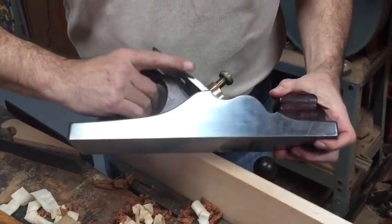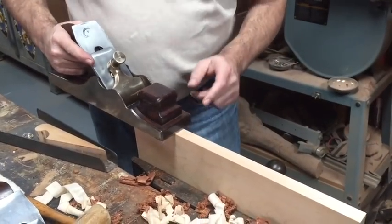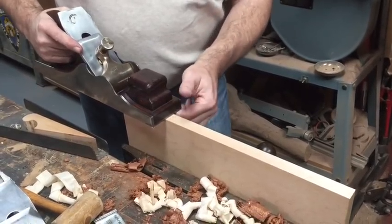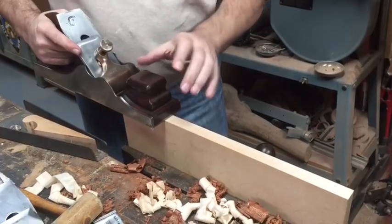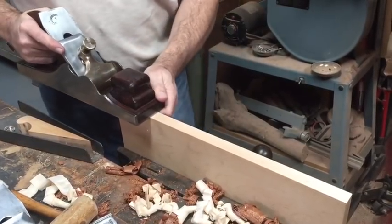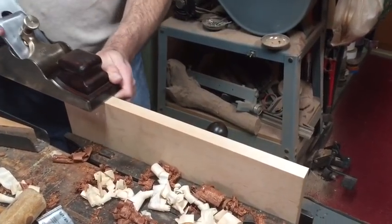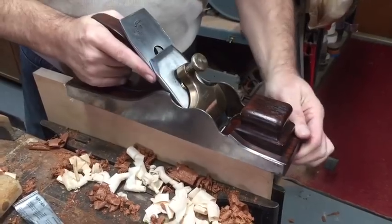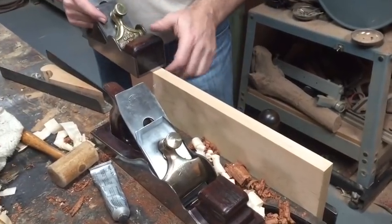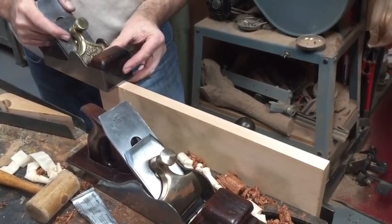The hand grip is a little too small for my fingers so I keep one or sometimes two fingers out. I really like some English planes where they extend a little bit of metal here, because when you're coming down it's nice to hold it there. There's enough of a lip that I can put a finger, because I like to ride one finger against the wood and the thumb on top — when I'm planing, it keeps it in a straight line.